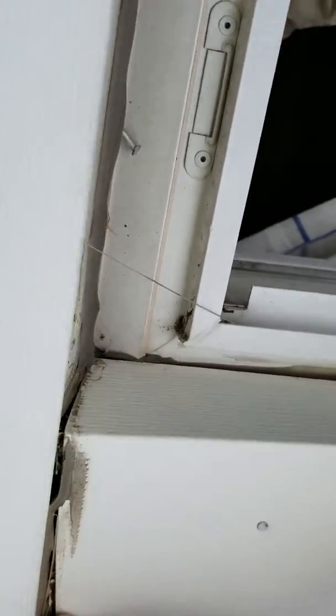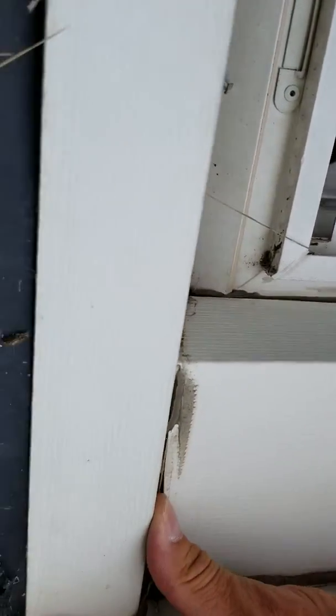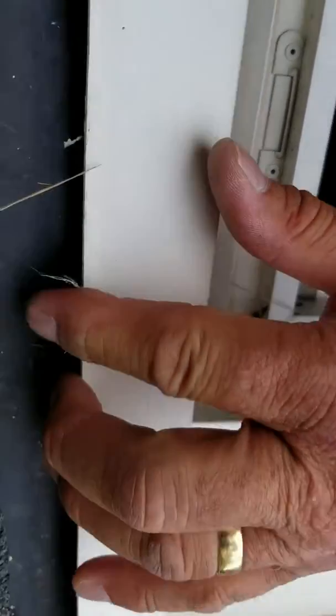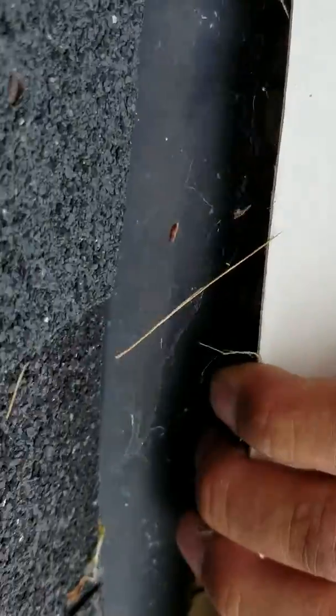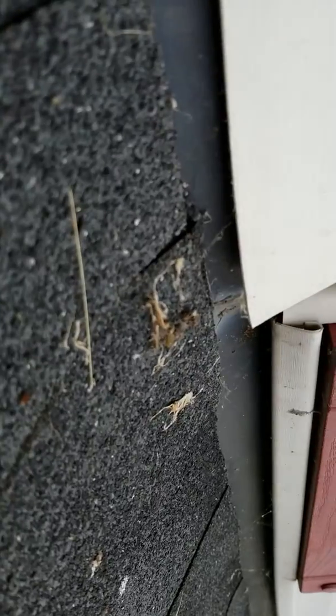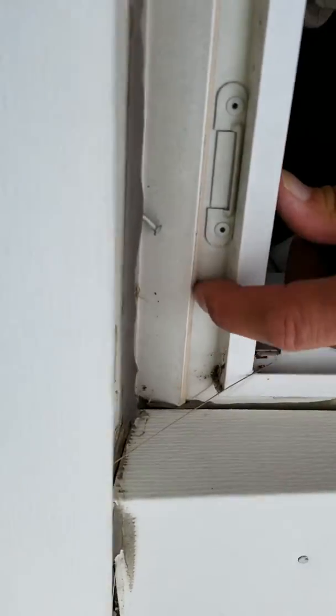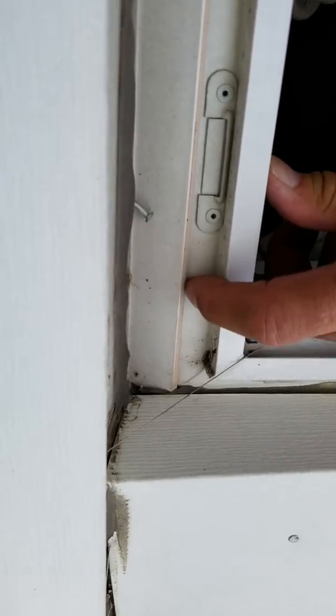This vertical that delivers down onto the sill is also an issue — the caulk is cracked and you can tell the black flashing is not right. So this also needs to be sealed right here where this upright never got set in caulk.